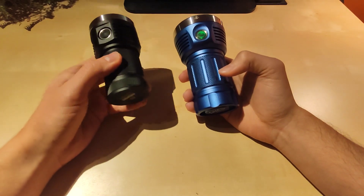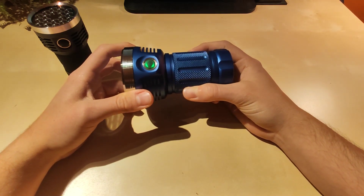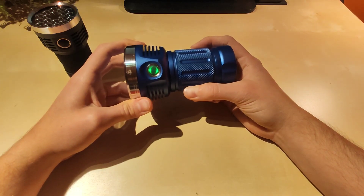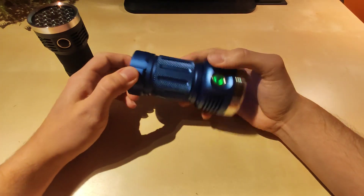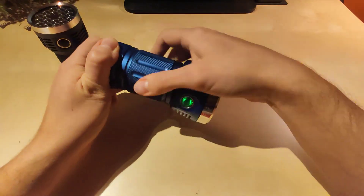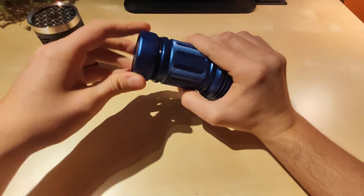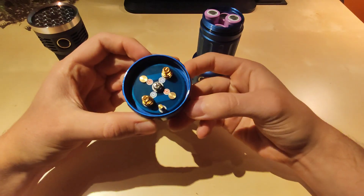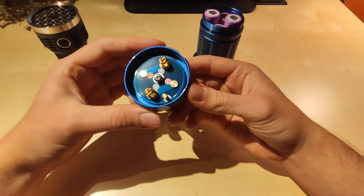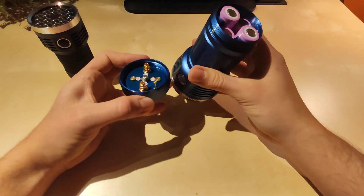The MF01S is a bit different — it uses a different driver design, it's Lexel's project. It's more like a dual-channel FET, if I'm not mistaken, without AMC at all. So it's more like a direct drive without stabilization. The main difference is it uses four 18650 batteries instead of three, so a bit more power. And the design allows you to use flat-top batteries by default — that's a nice addition. As you can see, there are no plastic rings, just plain flat contacts. I'm using flat-top Samsung 30Q here and it's working pretty decent.